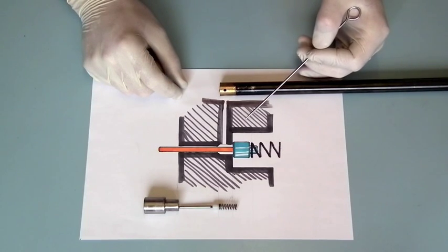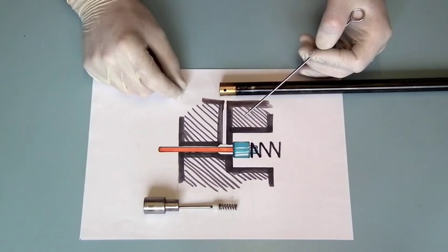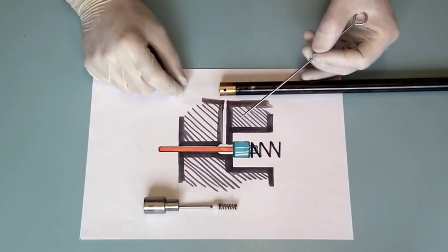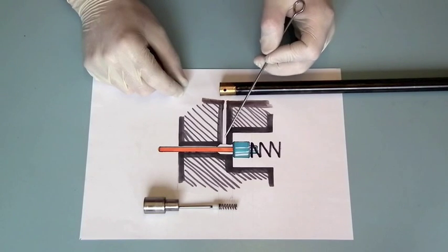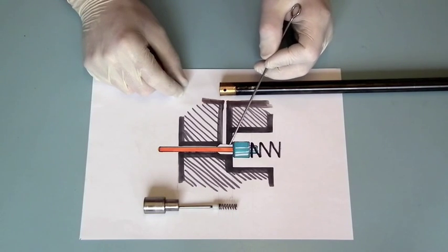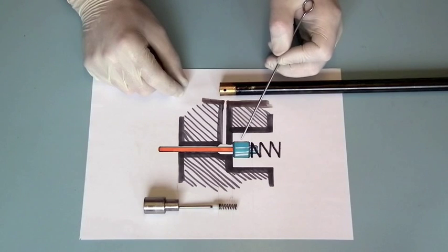Now, there's a few things you need to take care of when doing this, so as you don't have a nasty accident and spoil your rifle. And I shall try and go through these now in a logical order. So, to start off with, your transfer port is going to pass down into a slightly larger counter bore where the air escapes around into.